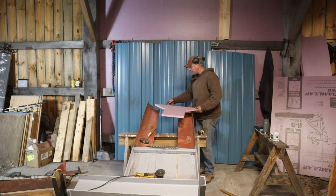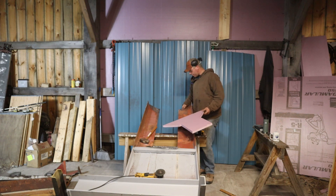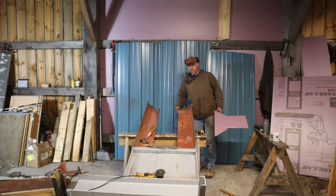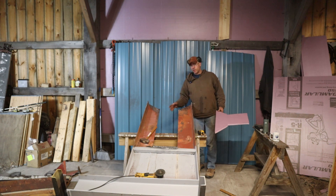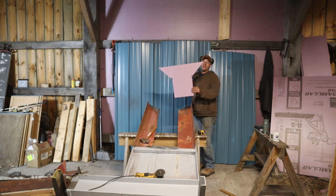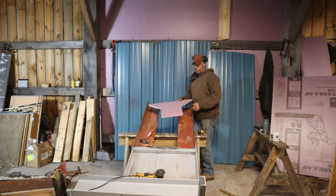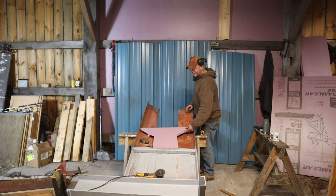What I've done is notched this top out on both sides at a 45-degree angle, carried it out, and then we're going to have a flat piece there to mate to it all in one piece. I had to do a little bit of a template on there and I'm going to try to make this thing line up and look halfway decent.